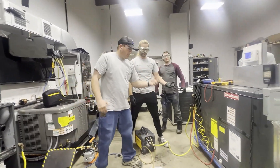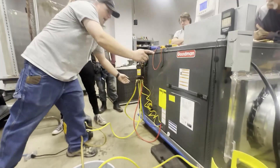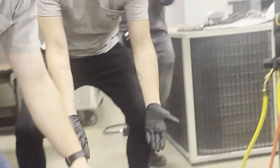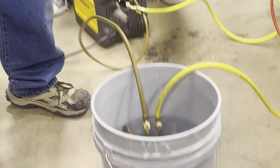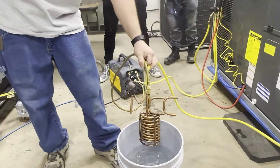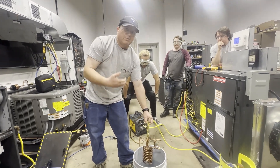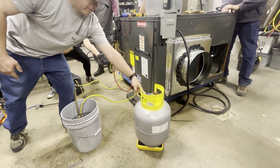What we're going to do is open these valves here — that's going to let the refrigerant out of the air conditioner unit to our manifold. Then the refrigerant will come down this yellow tube into here, and then to our recovery unit, and from our recovery unit into our molecular transformator. This is to make sure that our refrigerant stays in a liquid form instead of going to a gas form, which makes recovery time much quicker. After we come out of the molecular transformator, we come into our recovery tank.